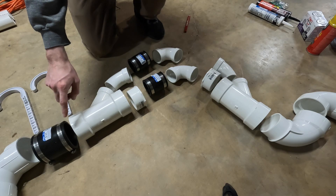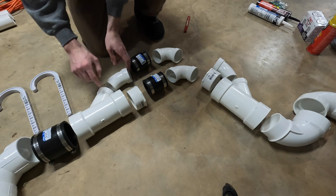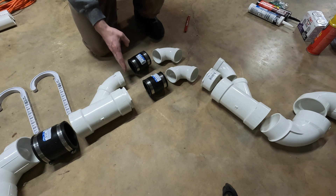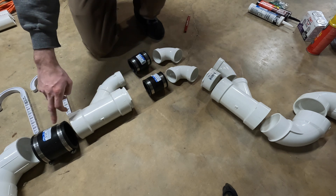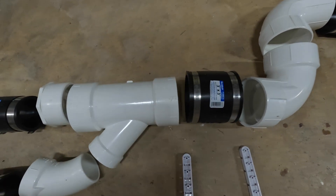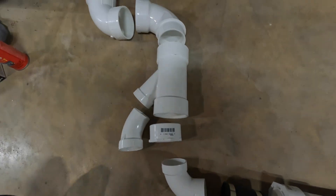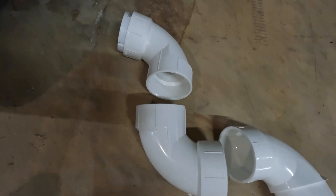To go from 3-inch PVC to 2 runs of 2-inch PVC, I'm using a Y fitting for 3-inch pipe on either end with a 2-inch offshoot. I used a 2-inch 45-degree street elbow to make it parallel to the main line, and in the end of the Y I used a 3-inch to 2-inch reducing bushing. This splits the 3-inch line cleanly into the 2-inch lines that go through the wall. Once through the wall, I'll do the same thing to bring it back to a single 3-inch line where I'll install the fan. I'm also using various PVC elbows, pipe, and flex couplings to complete the routing. The flex couplings make installation easier, allow me to angle horizontal pieces for drainage of condensation, and make it easier to remove the sump cover for service.